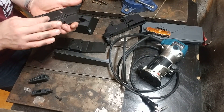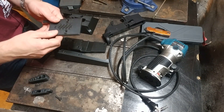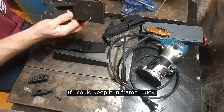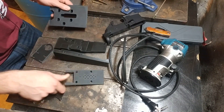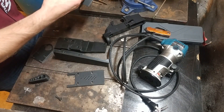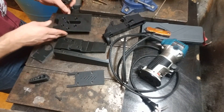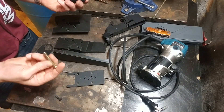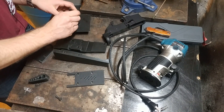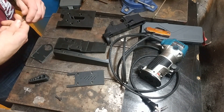Because of the grooves on the bottom, you want to print this upside down — bottom side facing up while you print, then down while you use it. That's important because this array of holes is not symmetrical, and neither is this pocket. I wanted to stay as true to the blueprints as possible, so I made it the official way. This other piece is also asymmetrical — it fits right in there, drops all the way down and through, and has a little slot for engaging in fun and wholesome activities. The holes on this piece are also meant for tapping quarter-20, but only to give you a place to put a bolt in as a handle to pull it back out again — otherwise it'd be stuck in there.